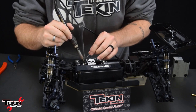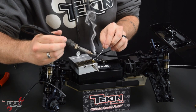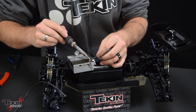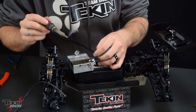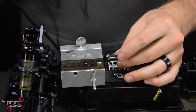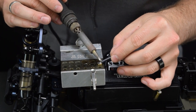Now I'm going to go ahead and wire up the rest of the car — this is where you're just going to have to practice, be patient, and be really careful what you do with your soldering iron so you don't melt anything. I like to solder everything in the car so I can set all of my wire lengths exactly how I want them. The Jigs Up is really helping me solder these bullet connectors because those are a pain to hang onto, and they fit nicely inside those pockets and hold them nice and steady.